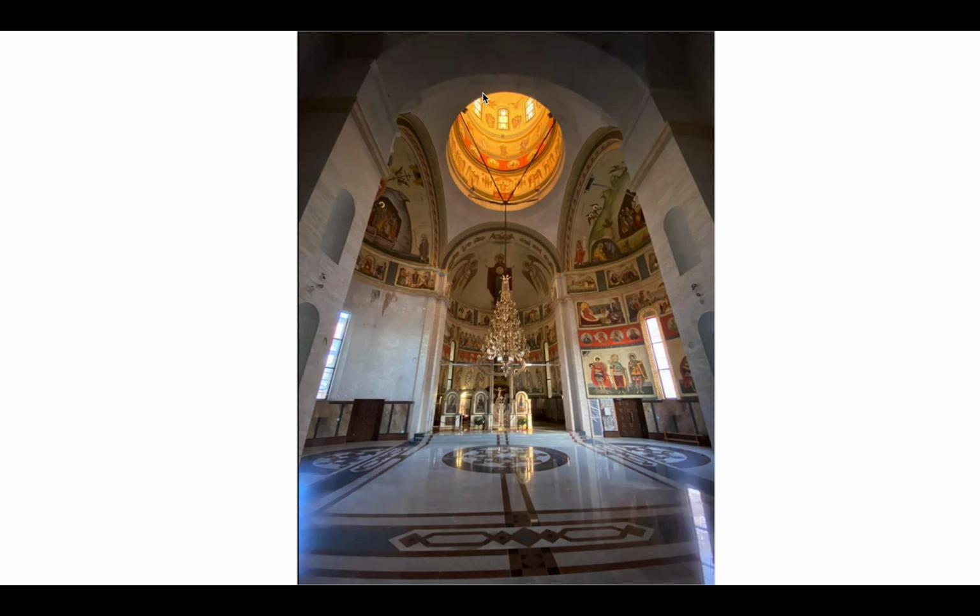So you can see now the dome, how it's looking from the ground level. Here is just a preview. You see that I actually use projectors with a CRI of 90 to have a very good color rendering index, and also a warm light. So I chose a projector with a color temperature of 3000 Kelvin.